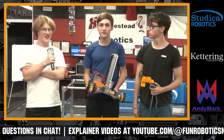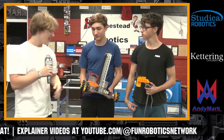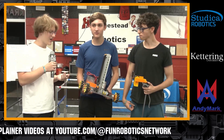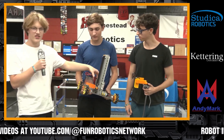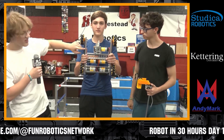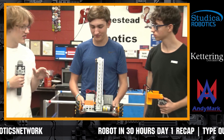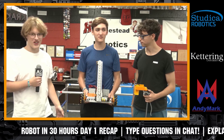We are 7974, Great Scott, and we've made quite a bit of progress so far. We started off with a pretty basic drivetrain — our motors are nested in the back. Two of them are direct drive and two of them are belted, as you can see. The belts are here and direct drive is here. It gives us a nice low center of gravity because we're actually reusing belted slides from our Power Play season. Not as fancy as GearHeads' belted slides, but we're trying our best.